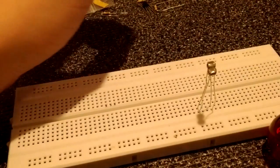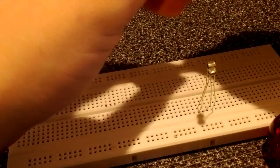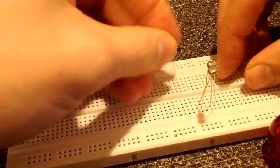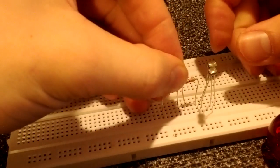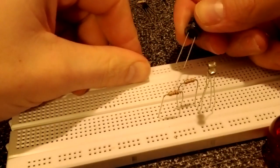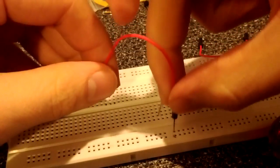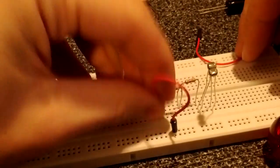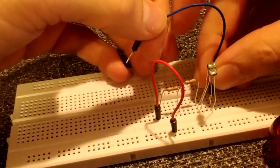So we saw right there that our resistance in the photoresistors, this little parallel circuit here, is bouncing somewhere between 5,000 and I think it was 50,000. So if we put two resistors upstream, these are both 30k resistors, totaling exactly 60,000. 60,000 ohms in series with about 30,000 ohms is our threshold. That means that 2/3 of the voltage will be burnt off up here, leaving only 1/3 for the bottom. So if we were to hook this up in our circuit, top rail, there, the current flow in here is going to be very small, obviously, because we have about a 100,000 ohm circuit at this point. There's not a lot going on.